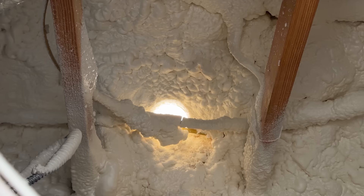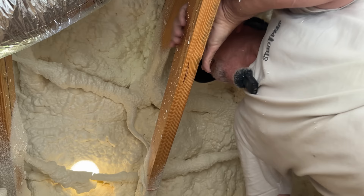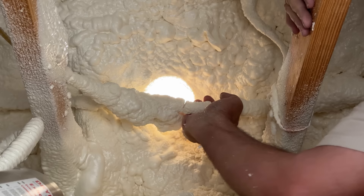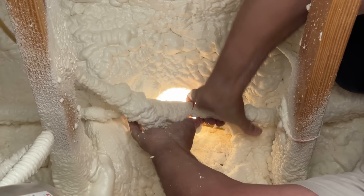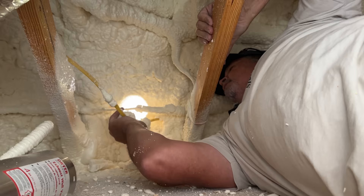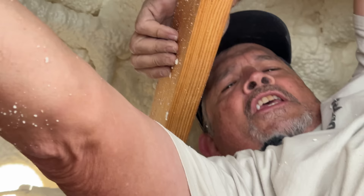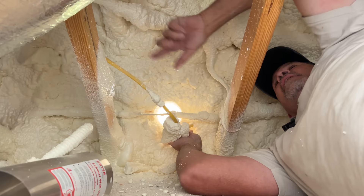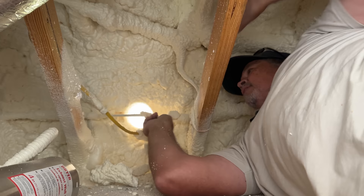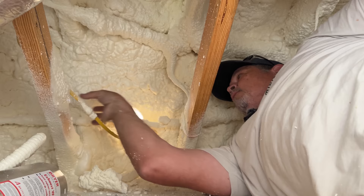Up here in the attic space above the stairs — I hit a wire. Looks like you hit two. Out of all the things I've hit, I could probably count them on one hand, but that was kind of a bonehead move — those are the same two wires we were dodging before. Should have had somebody in here. This first wire is fine — the insulation is just cut, it's for the ERV circuit, I didn't get it at all. The one I did cut is for the ERV power — there's a single-gang junction box right here. That's an easy fix: cut it back, add a junction box, and run a new wire to the existing junction box. Kind of dodged a bullet — if I'd cut the 14-3 I'd have needed two junction boxes.